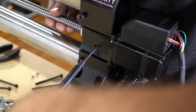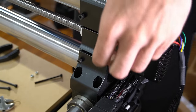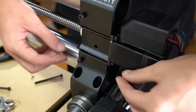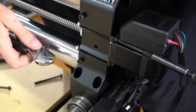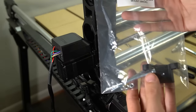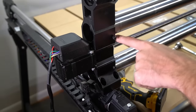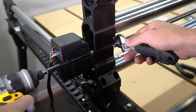Once we've got our new motor and coupler secured to our ball screw, we're then going to reinstall the bolts on what will be the front of the X rail. I'm working on this backwards for the sake of this video, but this is the front not the back. With that secure, we can install the bolts on the front of the rail — these are the bolts and the eight millimeter nuts that we removed earlier. On the back side we're going to do the same thing as the Y1 rail, using a bracket to secure our drag chain to the rail itself. We'll finish securing the front of the motor in place using a four millimeter hex key and an eight millimeter wrench. With the front of the rail completed, we'll move to the back half and install our X axis drag chain mount back. To do this we'll use the two longer silver bolts included in the packaging. We're going to thread those through the foot, secure them with the eight millimeter nuts, then slide the bracket over those nuts as we did on the Y1 rail. You can see here we're tightening those down with a four millimeter hex key and an eight millimeter wrench.